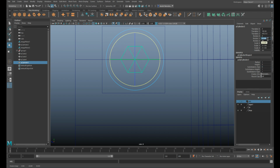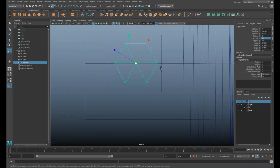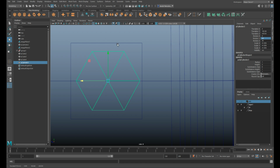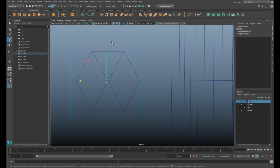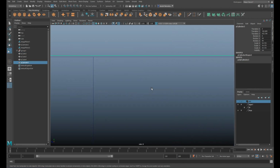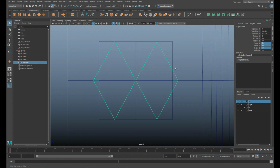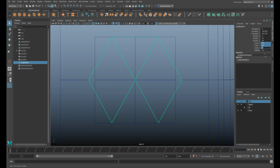So I'm going to actually use that orientation, and I need to find the center of this cube again in this direction so that I know that the screw is sitting in the center. All right, there you have it. And let's just make sure this is accurate. So we got 54, that's perfect. Okay, and I want to make it just slightly bigger to increase its tolerance. So let's do 55, so it has some extra wiggle room in there to sit.